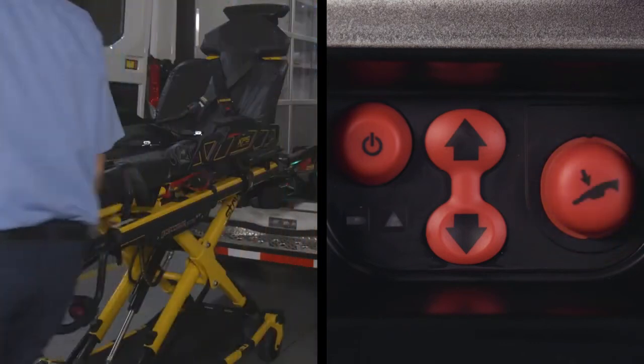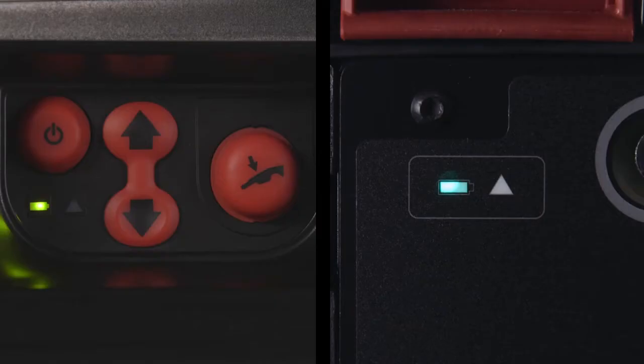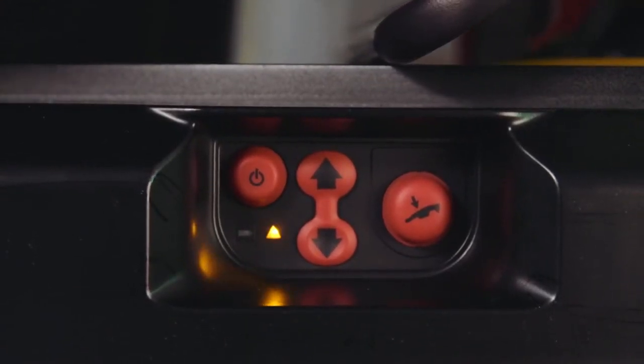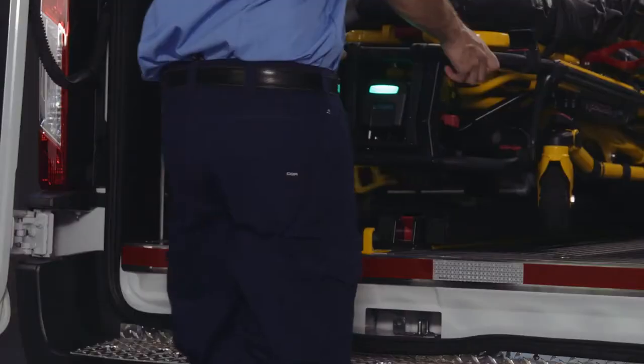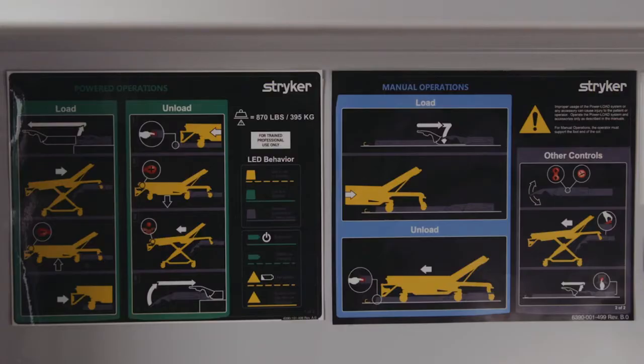There are duplicate battery and error LED indicators on the control panel and the back of the trolley. These LEDs display the status of the Power Load battery and system. If the Power Load system is in the transport position, the battery LED will flash green, indicating the battery is being charged. If the Power Load trolley battery is low, the caution LED will flash amber. If there's a Power Load error, the caution symbol will be solid amber. If this occurs, press the main power button twice to reset the product. If the LED remains solid amber, contact Stryker technical support. When Power Load is removed from the transport position, the battery LED indicator will change to solid green, indicating there's power.